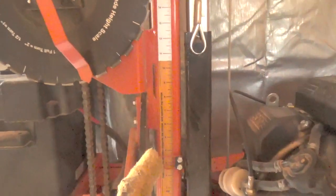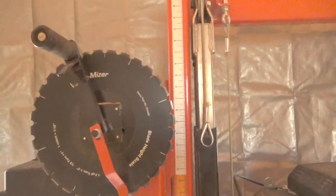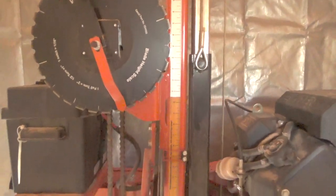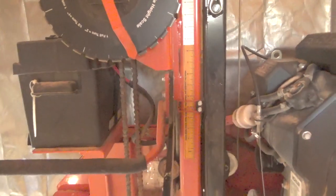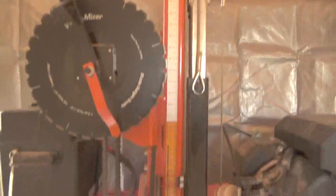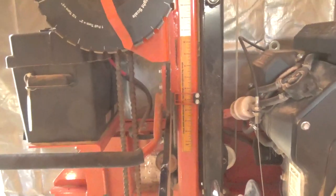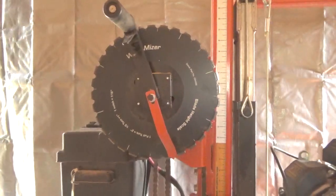Otherwise, I may say take a 2-inch board, which means that when you adjust the blade to be at the top of the log, you may want to come down 2 inches. The top of the blade may or may not be on an even inch mark. I found out that it's best to cut on even inch marks so you don't get screwed up in the end with a 3/4 inch piece or a 1/2 inch piece that you can't use when you're trying to cut full 1 inch boards. So the best thing to do is just work with the 1 inch marks in my case, and you can do this any way you want to, but that's how I figure it out, and it works really nice for me. So I hope that answers your question as far as how you figure out where you're at with the blade.